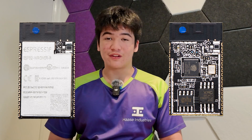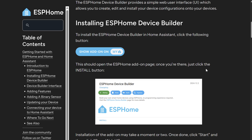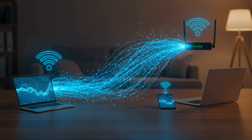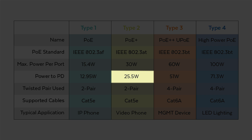For home network integration, the obvious choice is ESP32 with its extensive libraries and on-chip wireless support. But this time, instead of powering it through USB-C and controlling it through Wi-Fi in the finished product, we can use PoE Plus for up to 25.5 watts of power and data through the same port.